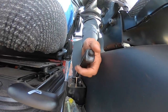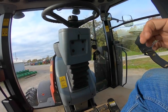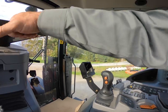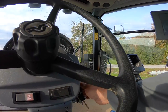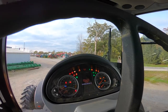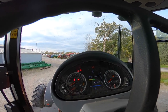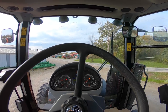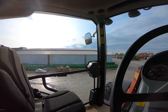To start this tractor, the park brake has to be locked, clutch pedal pushed down, gear shifter in neutral, and PTO off. Turn the key on — it's a good idea to wait until the dash powers up and the Versatile voltage screen comes up before cranking. The tractor has now started.